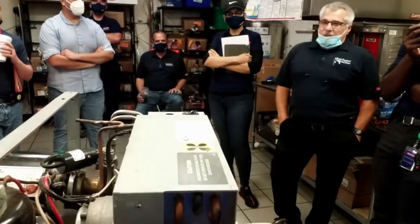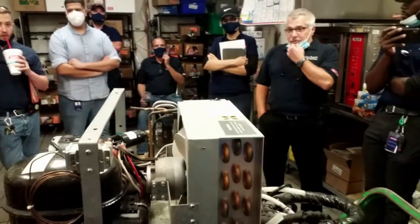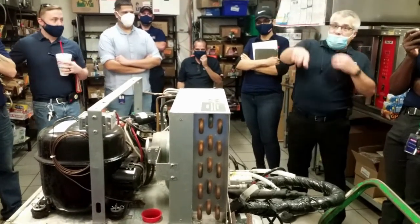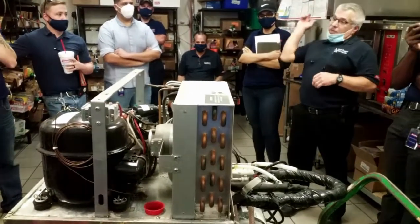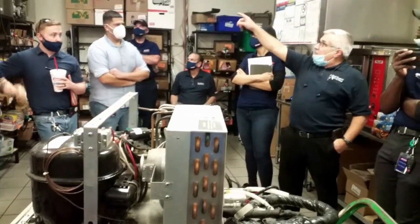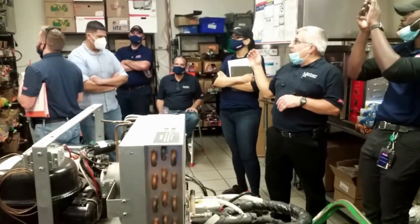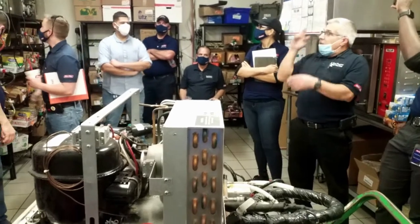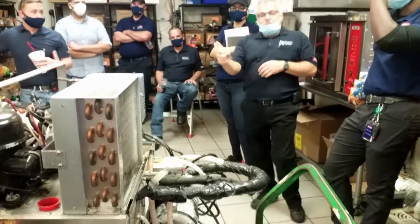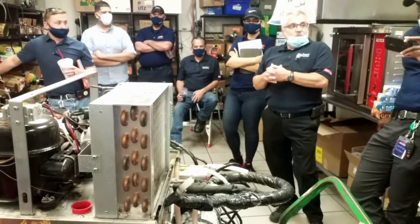What the chiller does is carbonates the water and then chills it and then circulates it up to the fountain and back. That's what that circulator does. So you see all that bundle tubing right there. All of the carbonated water lines go up into that one bundle. So they're all constantly circulating up and back. So when you open that valve, you get cold carbonated water out of it.